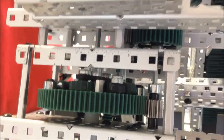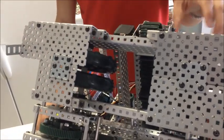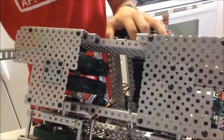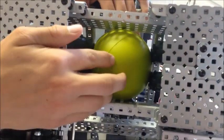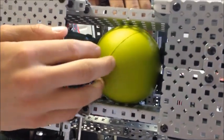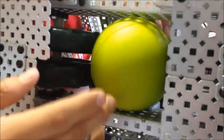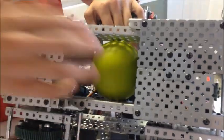The next thing we had is the spacing between our launcher wheels. We have 16 holes between the shafts on the wheels — that's 18 if you're going all the way to the shafts. These are 5-inch wheels, so if we stick this in here, you can see the compression we have on those. The wheels are separated by the largest of the varying size spacers that you can order, the white ones. For the up and down, we have 4 inches, so it's just over the size of the ball in order to have clearance.